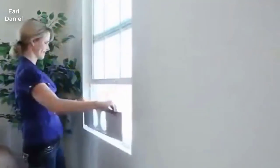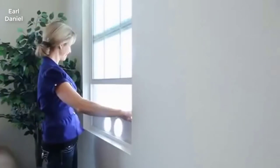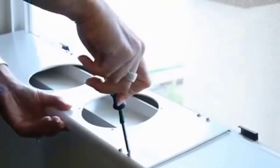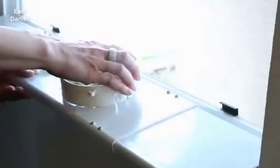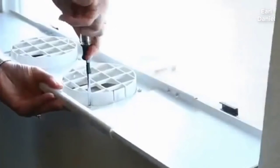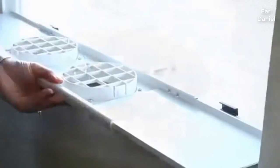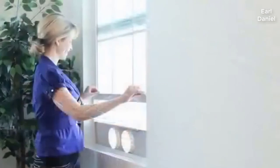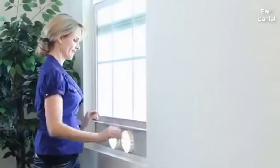Lift the window and adjust the window slide bars to the width or height of your window. Tighten the screws to hold the slide bars in position. Make sure the grooved side of the window slide bar is facing inside. Insert the fixtures to the holes of the window slide bar, ensuring the two closure tabs of the fixture are facing the inside. Install the four screws of the fixture from the inside — the end of the screws should point towards the outside. Close the window tightly enough to hold the slide bar in place.